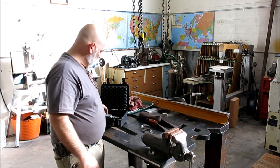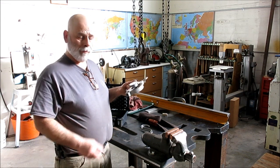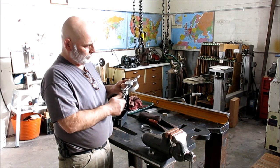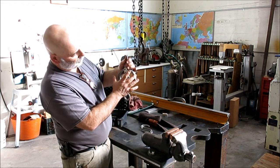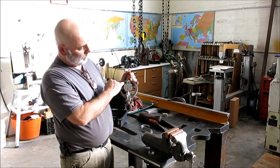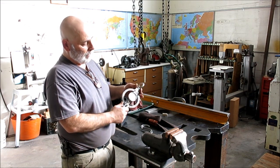This is a device that I made — it's got a date on it: 1992. What this is called is a ring dynamometer. You can actually weigh things with this. The way it works is you pull on it and this ring distorts under load. We measure that distortion with the dial indicator. If you calibrate it, it's fairly linear, so you can get some good readings. This is actually fairly common technology — I didn't invent it, I was just too cheap to buy one, so I made one.